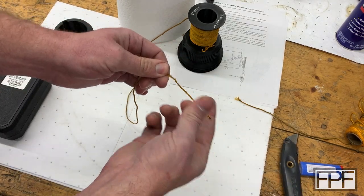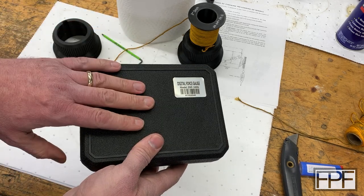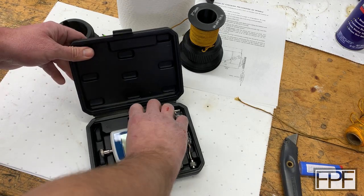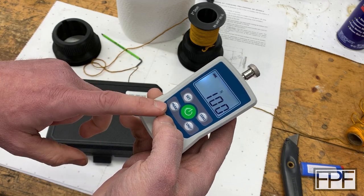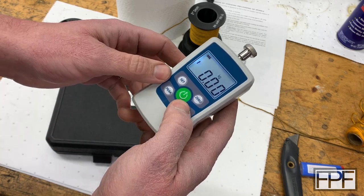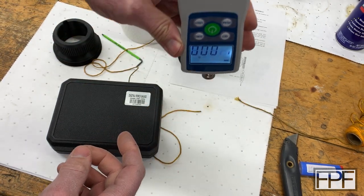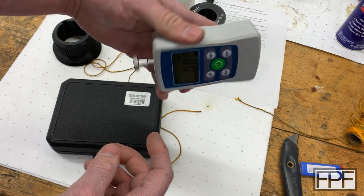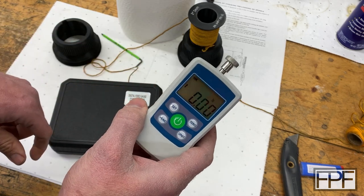On the other end of this, we need a way to measure how hard we're pulling. As I mentioned, I was going to order a much better force gauge for small amounts of force like this, since we're going to measure like one or two pounds — and it has arrived. I played with it a little bit yesterday when it came. This goes up to, I think, 22 pounds. I was really curious how accurate it was at much smaller amounts, so I set the unit to pounds, turned it upside down, calibrated it, and pushed down on a postage scale — and it was very, very accurate. I was not seeing more than about two or three percent difference from what the scale was reading, even at really small amounts well under one pound. I think this is going to do the business. If you like to nerd out on measuring equipment like this, I'll link this down below in the description — I got it off Amazon and it was not expensive for how accurate it is and the fact that it measures in push and pull.